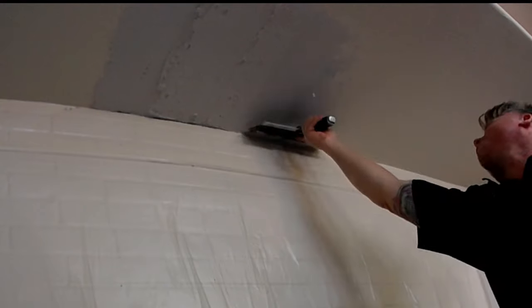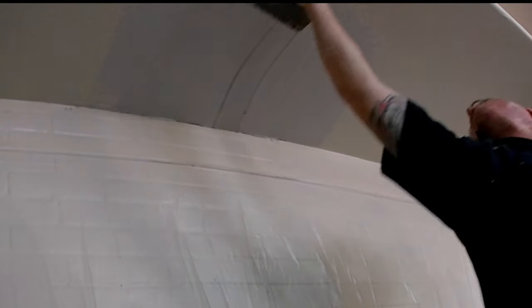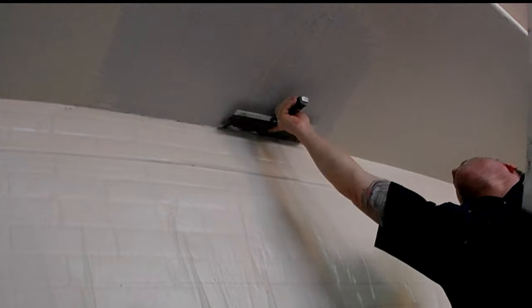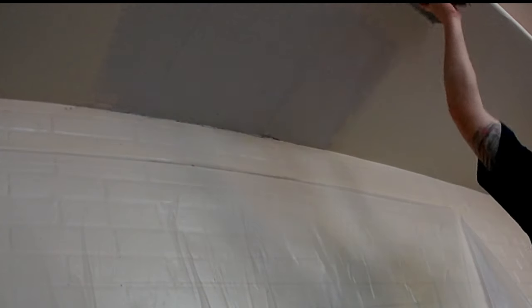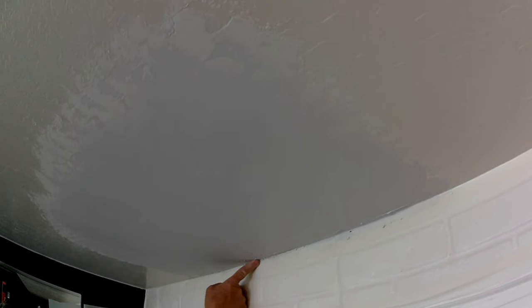If you're more experienced you can use hot muds, but just stick to joint compounds. We do drywall every day so sometimes we get away with a heavy first coat with hot mud, then slick it out almost like a second coat. You're going to need at least two coats, maybe three tight coats for a nice patch. When in doubt, skim it out again. Texture is not meant to cover up imperfections — your patch needs to be perfectly smooth before you texture. Ask yourself: if I painted it now, would it look good? If not, you need another coat.